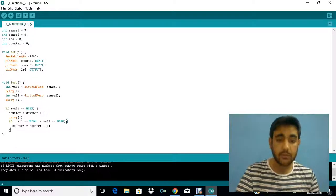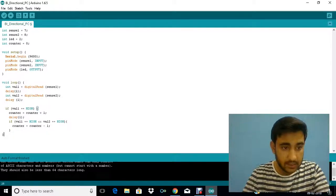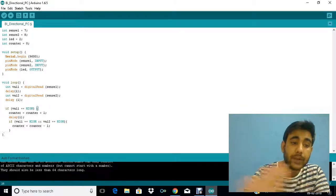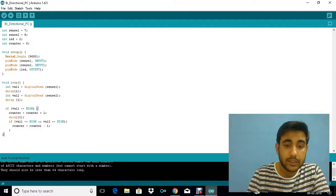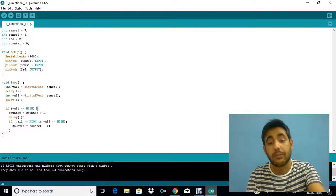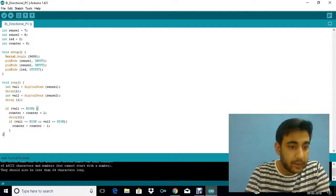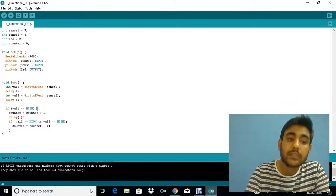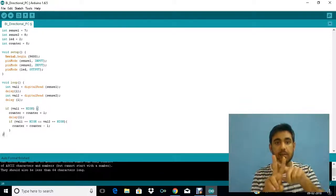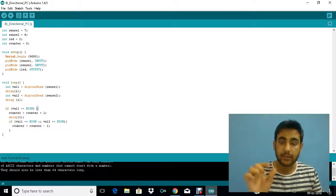So it just goes from 1 to 0, then 1 to 0. Now this is done. This is the first command, wherein I go from left to right, and there's a delay in between of 500 milliseconds, which is going to come later in the program, and I'll tell you why. Because if we write a delay of 500 milliseconds right now, it's never going to read the value 2. It's just going to miss it, because the object will cross without the 500 millisecond delay being over.